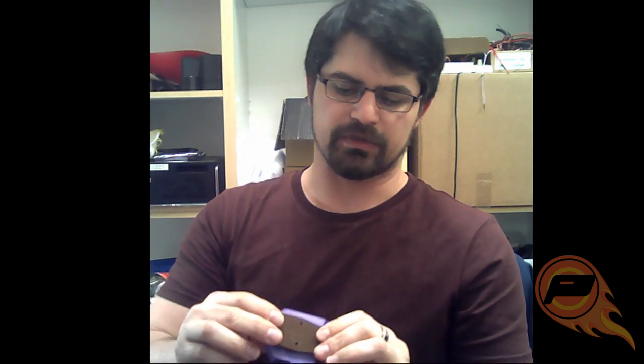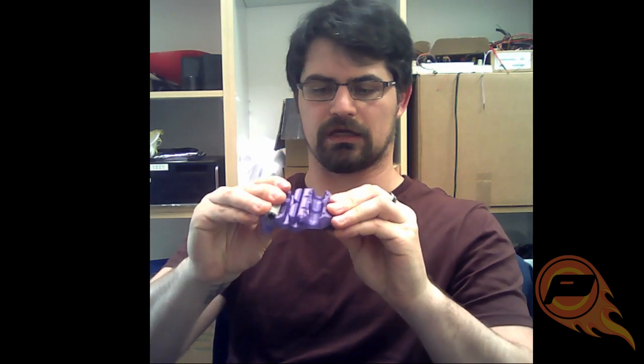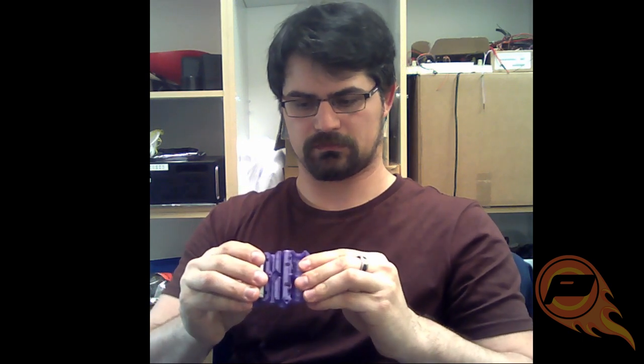What would be the best approach to mounting the piezo? Now that is kind of dependent upon what it is you want to do. If you want to use the FFC version of my sensor, then you have to do it on the printhead, or you have to have a separate standalone sensor. Like I was showing you earlier, you need to have some way for the piezo disc to be flexed as the extruder touches the bed. So that's the main factor you need to take into account. If you can get it to do that, pretty much golden.